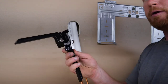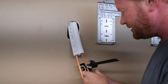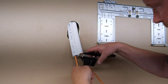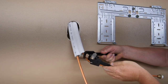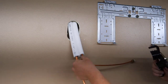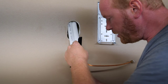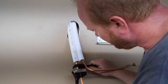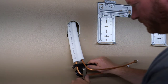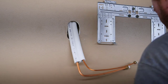So I picked this guy up on Amazon. I'll put a link in the description below. This just goes over the tube and gives us that nice bend that we want. So this is a multi-fit unit. And that gives us that nice 90 degree we needed. That was a small line, that was the quarter inch. This one is 3/8, so that's gonna be on the bigger one down here. Now that I got those nice 90s bent, put the insulation back on, and we're ready to bolt it down.